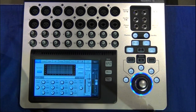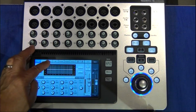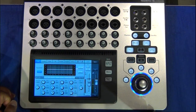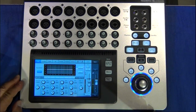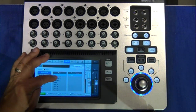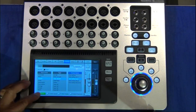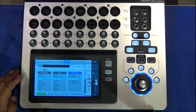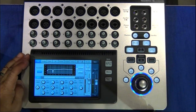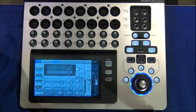If I click on the number of any individual channel, it comes up with all the individual channel controls: my equalizer, gate, comp, effects, aux sends, and presets. One of the nice things is, if I don't know what I want to do — let's say channel one has a kick drum — I can go to my presets, say I have drums, tell it it's a kick, and even select whether I have a subwoofer in the system. So I'll say kick with sub, jazz style. Then I select recall preset, and all the settings for that particular drum are already set up for you. So you don't have to do anything — everything is basically ready to go.